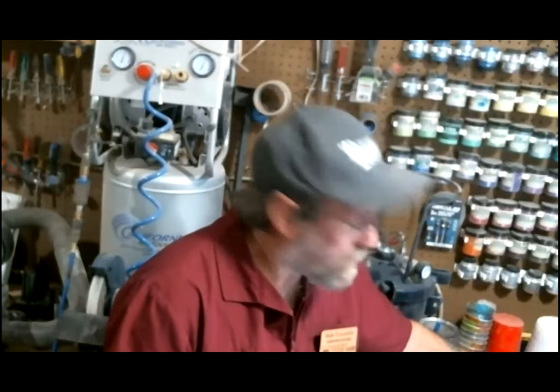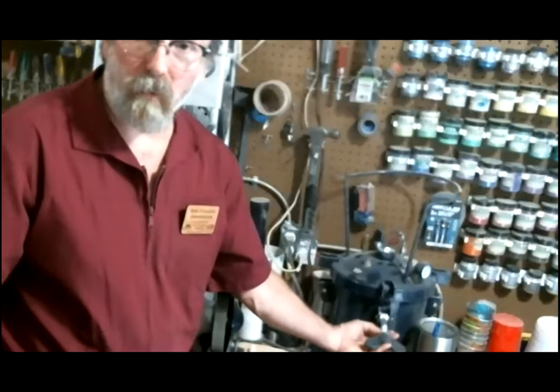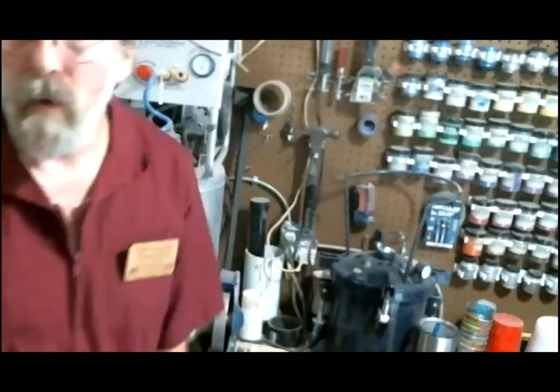Yes, I absolutely have a blow-off valve on my pressure pot. That's a must-have for me, and I push it to what I'm comfortable with on that pot. Like I said, a Harbor Freight pot, I don't trust at all. They have very, very cheap quarter-inch, basically, or 5/16 bolts that are Chinese steel. I don't really like them for the lid. On this pot, you see you have big 5/8 bolts that actually latch it down. I trust them a lot more.